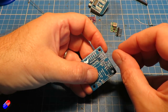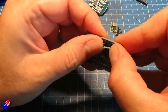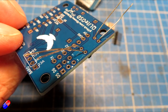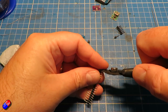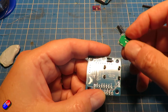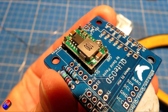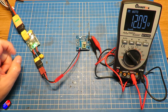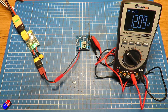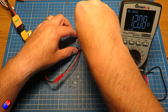In terms of putting it together, it's pretty straightforward. First of all, solder in the two resistors — the 30k and the 7.5k. It's written very clearly on the main board which goes where. Then use four separate header pins to connect in the mini 360 power board. Make sure you're matching the arrows, and then once that is done, pop on a couple of power leads — make sure you've got positive and negative the right way around. Then pop a voltmeter onto the output pins on the top right-hand corner and twist the little screw so that you get between 5.5 and 6.0 volts.